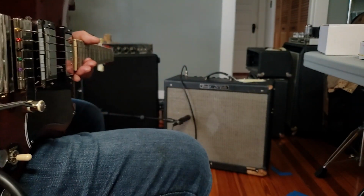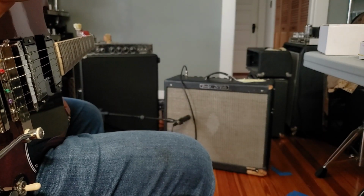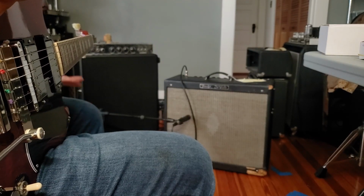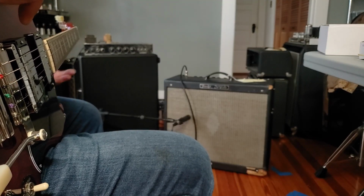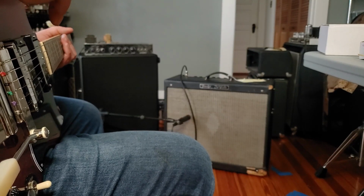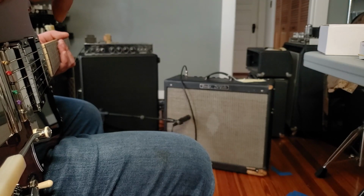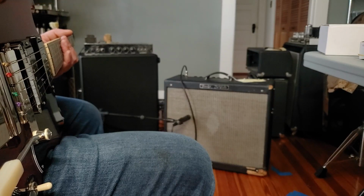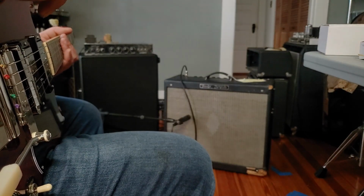More on that later. While the amp still sounds like a Hot Rod DeVille, and it's real mid-y and bassy, I think the Deluxe actually sounds better, but that's subjective. I can say that this sounds like a very healthy example of a Hot Rod DeVille, and that's all I need to worry about today. So I'm glad to put this amp hopefully behind me, and maybe if it comes back, it'll be more than 2 years from now. But I think the owner will be happy to only have a bill for a pair of 6L6s. We do what we can.